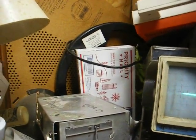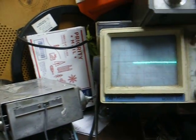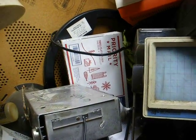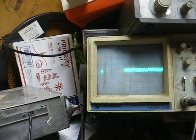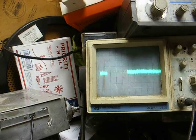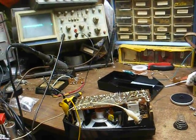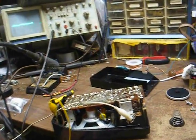There's not much here, but there looks like a little noise. Let's look at the base of the AF amp transistor — that's the input coming in off the volume control — and there's nothing present on the scope. Now let's move over to the collector, that's the output. Okay, there we go on the collector. There's definitely some white noise there, and it's enough to be heard in the speaker. I believe we can safely say that that germanium transistor is defective. Those older germanium transistors can be very problematic, and the white noise is one of the more common problems.